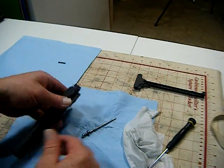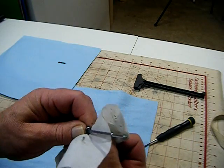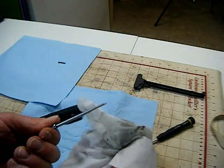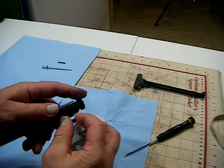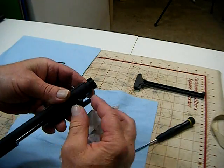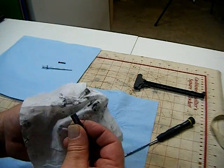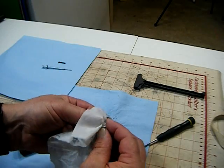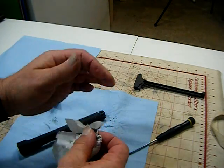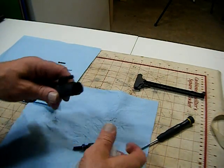Get the firing pin out, wipe that off. There's some gunk right around the end of it — we'll get that cleaned off, some carbon buildup. Get our pin out here. Like I said, I'm kind of used to my AR-10, but it's pretty much the same process — parts are a lot easier to work with. Bolt out.